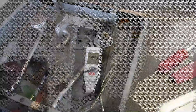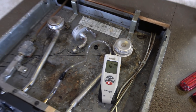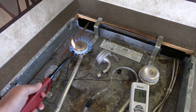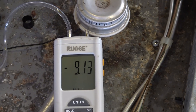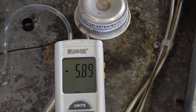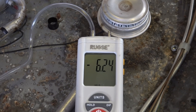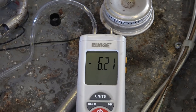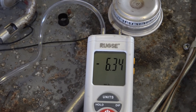I got both cylinders off. It's holding steady there. Let's light an element here - we'll use some gas. There'll probably be a fair capacity in the system, so we might have to run some of that out and let it drop a bit. You can see as I'm running the propane it's dropping. I'll turn it off and let it equalize again. At this point the trick is to wait about five or ten minutes and see if there's going to be any significant drop in the pressure. If I have a leak anywhere in my system, I'm gonna see that number drop.